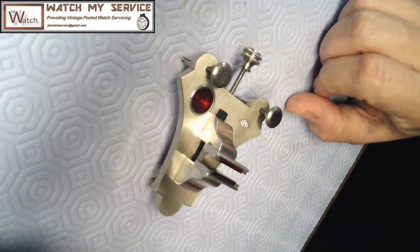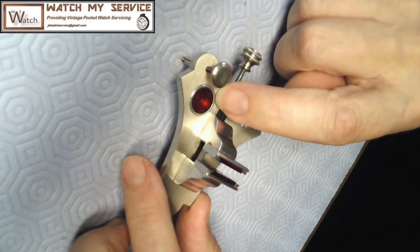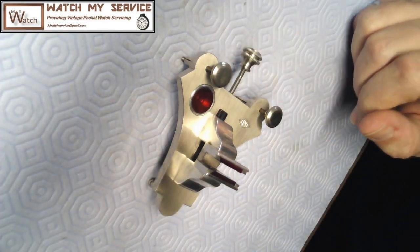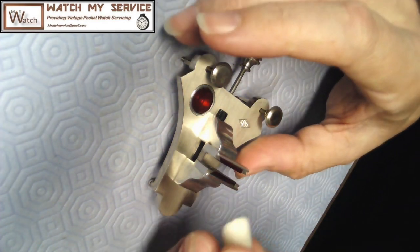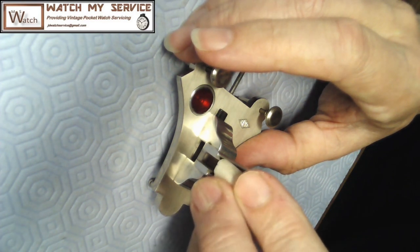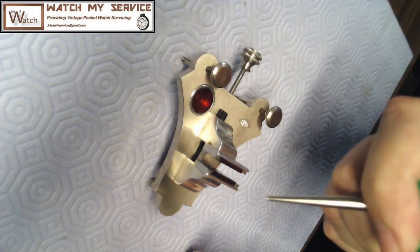If you have a poising tool without a bubble indicator it's a little more difficult to make sure it's level. Setting it up first, then take a piece of pith wood and rub it along the edges of these ruby jaws - I'll call them that, apologies if I'm not using the right terms - rubbing along the edge of the ruby jaws cleans the surface. Then if you've got any leftovers you just use a puffer and clean it off.